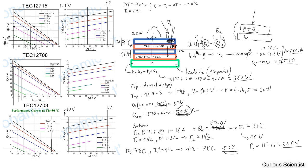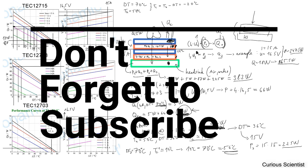The next stage should be able to remove this sum. The final heat sink at the very bottom must remove the product of all stages: P1 plus Q1 plus P2 plus Q2 — giving those enormous numbers. Now we've seen some numbers, and I think I talked enough in this part. I hope it was useful. Now I'll jump to the experimental part, which I expect to be more interesting, and we'll see if it works in reality as I calculated it or not.